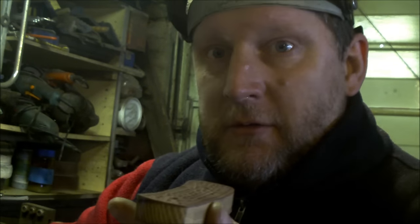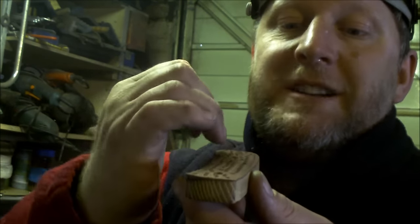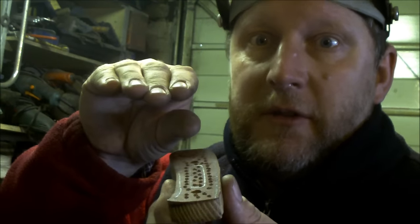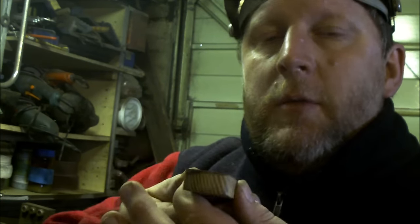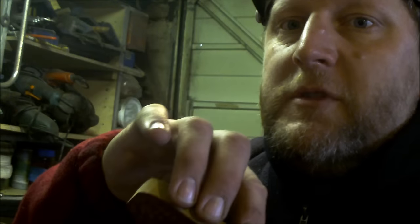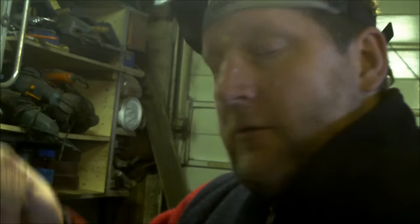obviously removed all the pencil, because graphite doesn't allow easy bonding because the layers come off. Once I've used the sandpaper or the abrasive to get rid of the burrs on the fiber liner, I'm actually keying down the fiber liner from its glossy manufactured surface, so that's going to be scratched up. But when you do it, don't press down further on one side than another, because you'll remove a lot of fiber down one end as opposed to another. You still want to go only enough to scratch it, and you're not actually trying to remove material, because you'll end up with a thinner looking red line on one end than the other. That makes sense. So I'll crack on with this and I'll see you in a bit.